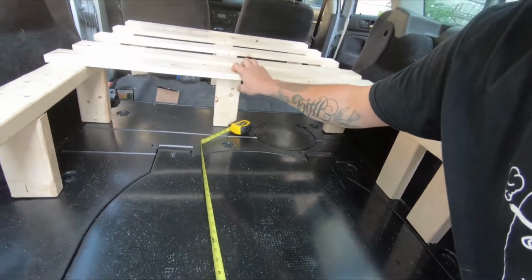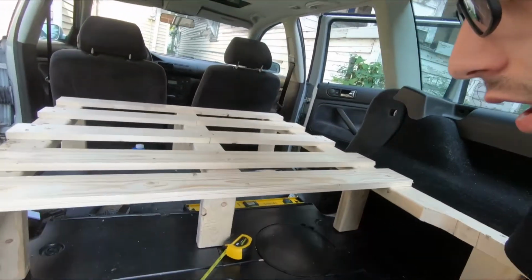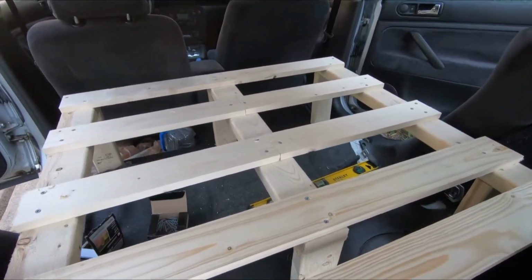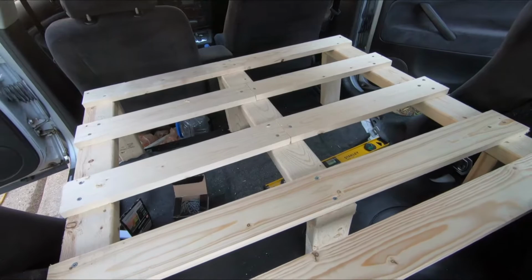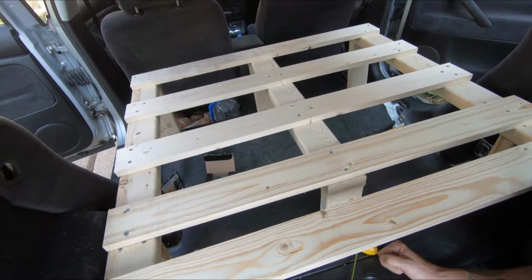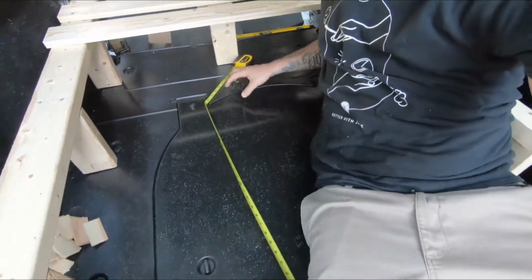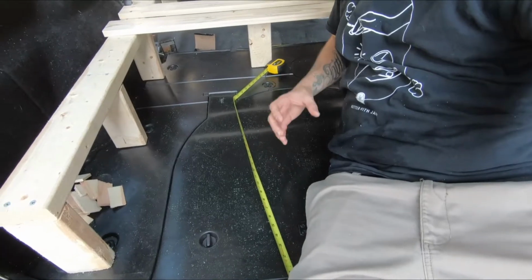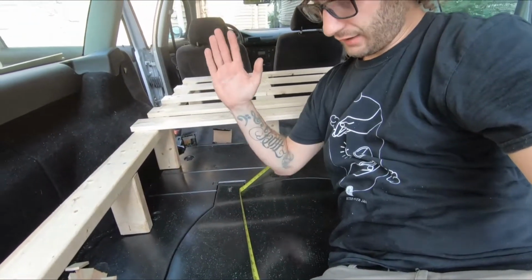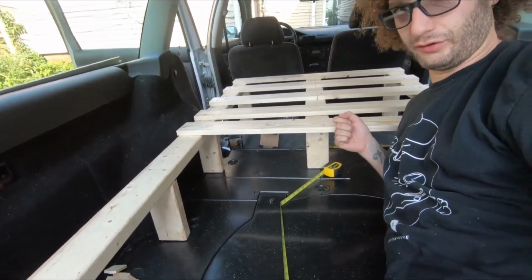And I'm going to place these bed slats on this half of the bed pretty much a lot closer than I have them spaced over here. Obviously, since we have the center support on that side of our bed, we can have some nice spacing there. But just to be safe on this side, since there's no center support, I'm going to put a couple of feet here that are going to lift up with the decking for our bed. And then I'll just place our slats here just a little bit closer.